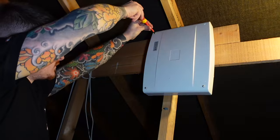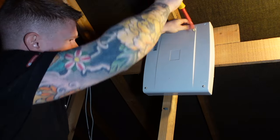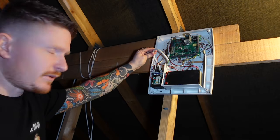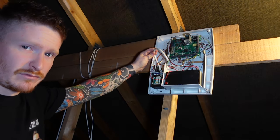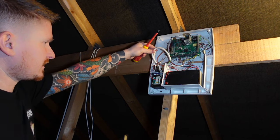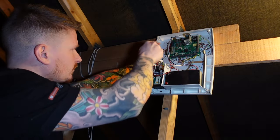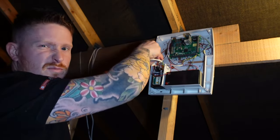When you open this cover your alarm may well sound — it's because there's an anti-tamper switch on the cover. When you open the cover you'll see that there'll be a battery inside. All you'll need to do is disconnect the red and black cable from the battery and that will stop the alarm. This is our power cable piece of flex that we removed from that FCU, and if you're not reusing any of this we can go ahead and just cut it, pull that through the back, and you can now go ahead and remove the control box — that'll just be screwed on.